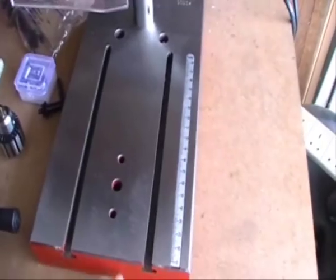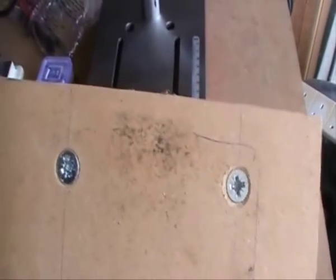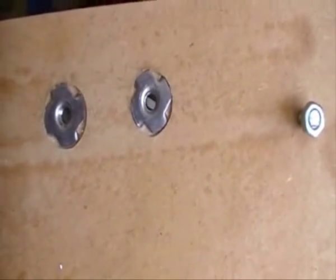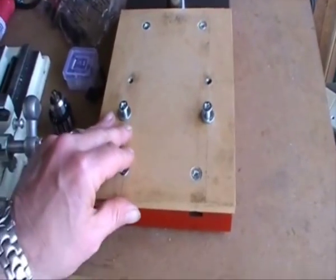The fixings on that do not align to the rails. So what I've done is I've made up a false baseboard, which just consists of four countersunk holes to get them out the way, with four nuts on the bottom. And to fix the actual vice I've used countersunk prong tees on the underneath — that just slots on there like that. Do it up, the vice mounts on there, and then you adjust it.